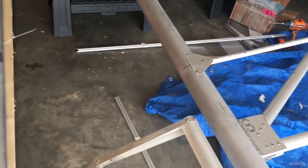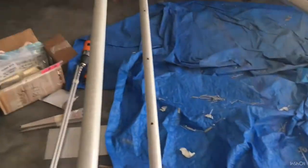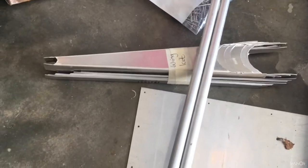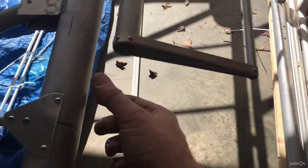What I'm going to do is just do the trailing edge ribs, starting about a half inch in. You'll see these two small tubes right down here — this is going to be for the trailing edge of the trailing edge ribs. There are 14 of them, and I'm going to attach them to the spar right here. They'll look kind of like the ailerons, except this part will attach to the trailing edge spar and the front will attach to those little tubes.